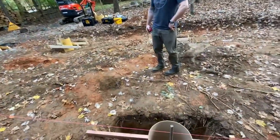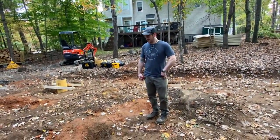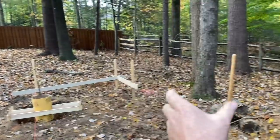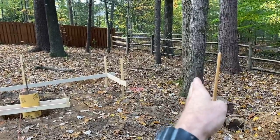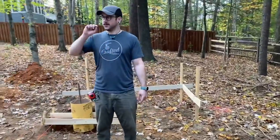While waiting on concrete, you think of all the random things you wouldn't have otherwise. We've got an excavator — why not go ahead and dig a trench for the sewer? Otherwise it's gonna be under the house and you're gonna have to dig it by hand later. That's not an option, or we'd have to wait on the plumber to come out and dig the trench before we frame the floor. We're thinking about where it'll run out to tap into the sewer, trying to stay five times the diameter of the tree trunks away, because the arborist told us that five times the diameter is the safe zone for digging without killing the tree.